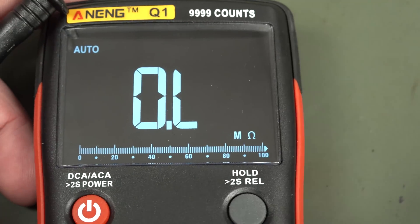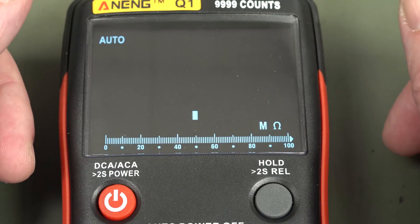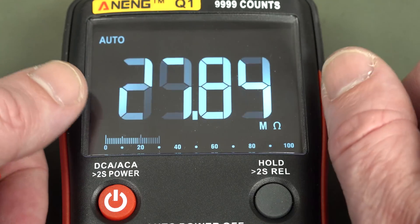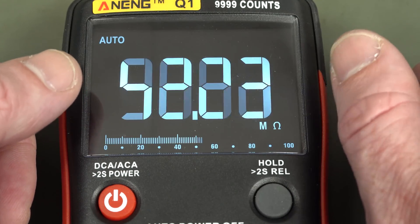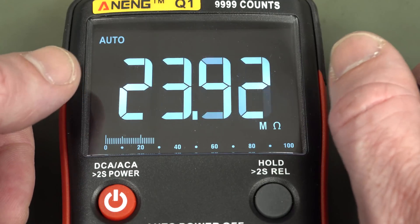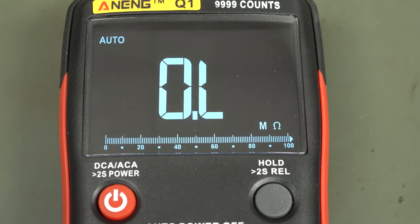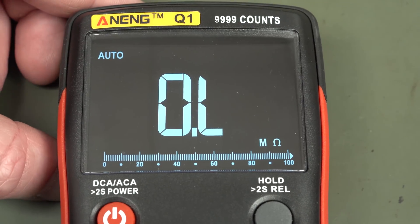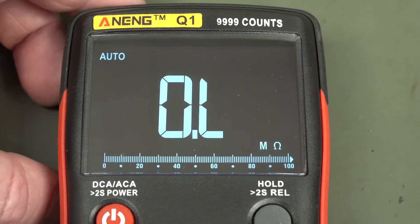As for this bar graph, I think it's actually a gimmick. It doesn't appear to be any quicker — you usually get 20 times per second for a proper analog bar graph, but this thing just seems to mimic the display. So I think that's a fake bar graph — that is useless. If you're going to have a bar graph, have the thing fast-update at 20 times a second. It's usually a feature built into multimeter chipsets, but in this case it doesn't have a faster lower-resolution ADC, like an 8-bit ADC, to get that faster updating. I think that's fake.